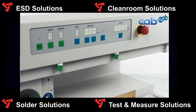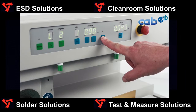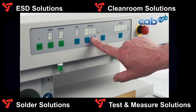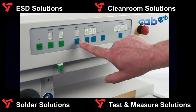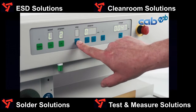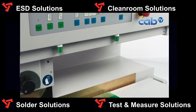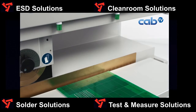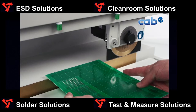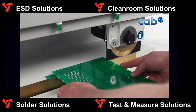Save this program as program 2. The blade distance at first cut is 0.3 mm. It is 0.15 mm with the second. Final cut with the third. Now the Maestro reduces the remaining material thickness. This is done automatically according to the data we had programmed with the operation panel before.